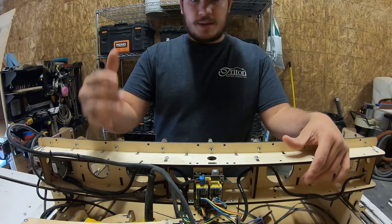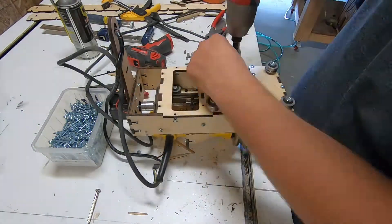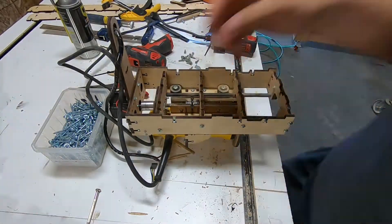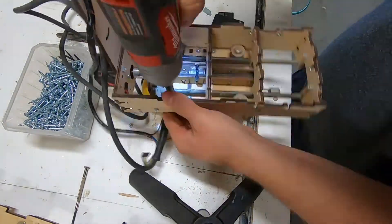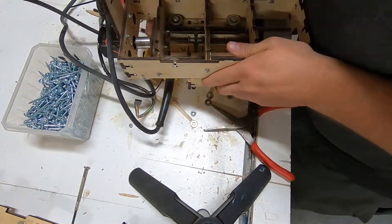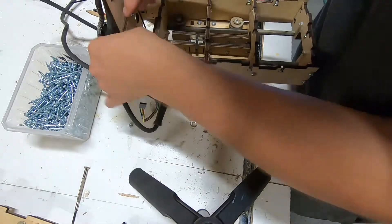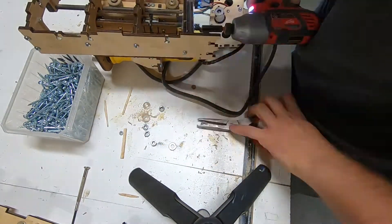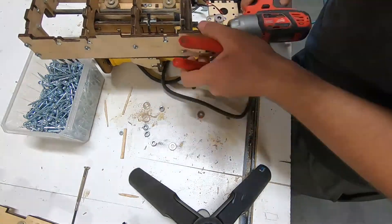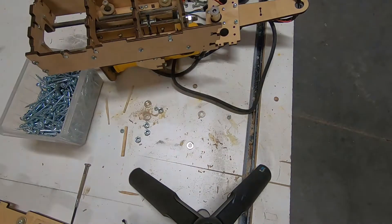Little did past me know how motivated I would get to get this done. Unfortunately my first round of brazing actually ruined basically that whole screw setup, so I had to replace everything. The problem was that I replaced that black threaded rod — which was bent as well and I think was causing me issues — with a new rod that's zinc coated. And I've been having nothing but issues with the zinc coating. I have to lube the rod up really well to make sure the z-axis does not hit a hard point and stop the program, so I will be replacing that.